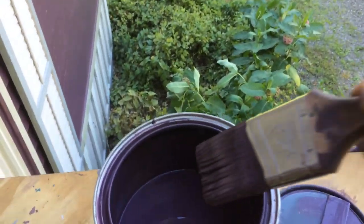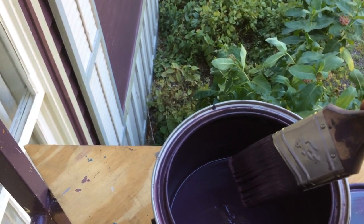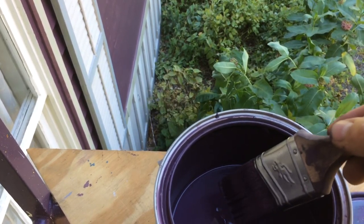When you're painting, you want to look out for drips — spots where you go through a hole and push paint up in there, and then later it comes back down. I like starting from the top and working down, because then I can look back up and see if I missed spots or if there are any drips going on. I can go back up and get them with the lift or however I'm painting.